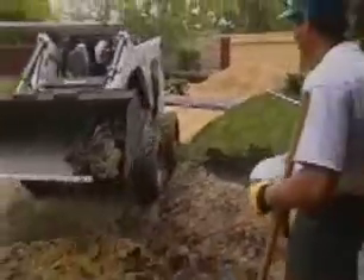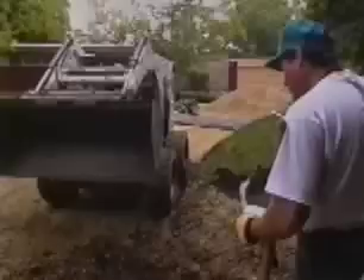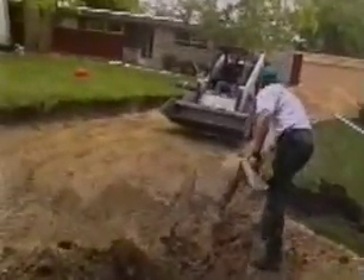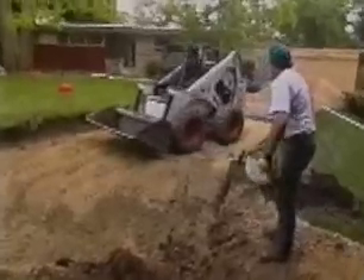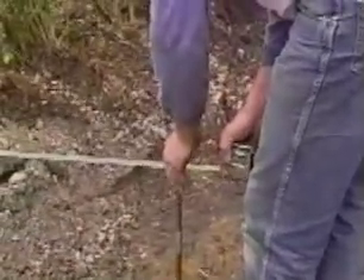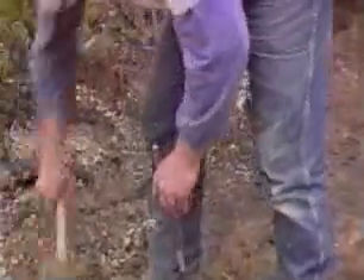You want to make sure that you excavate precisely according to the plan and grade. An under-excavated project will not provide a strong enough pavement. And if you over-excavate, you'll be hauling out more material and installing more material than was estimated. This ends up costing a lot and slowing down the project.